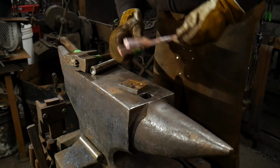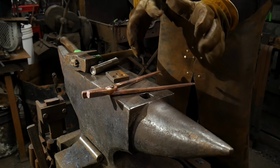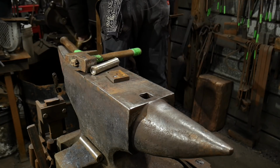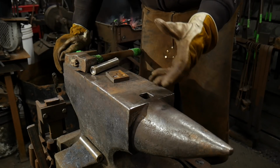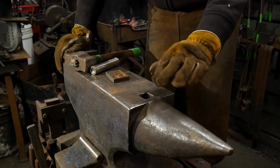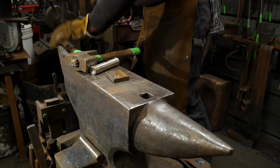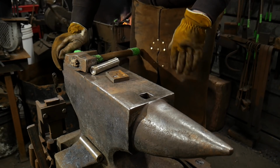Okay, so that's about as far as we're going to want to go with that for right now. And now we need to heat these up like we would normally do, but here's the exception. We can't hold on to these, so we are going to heat these up, get them to soften ever so slightly. We're going to go up to a very, very dull red. This isn't the high range of red that you can go to, or orange, where it will really be soft. Just barely get any sort of red color in it. We'll soften it ever so slightly, but it won't take it all the way to its fullest softest extent. So we're going to heat it until it turns, again, like a light red.